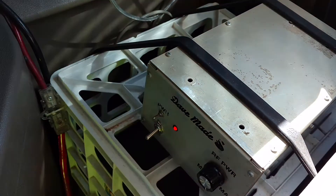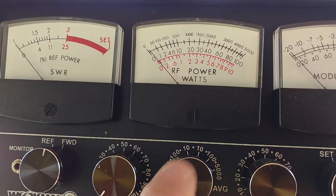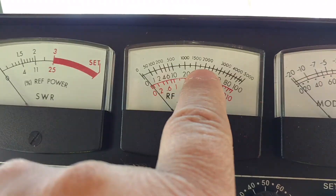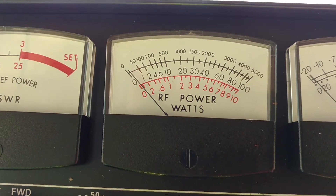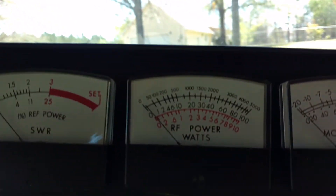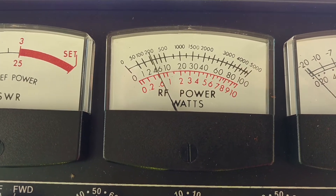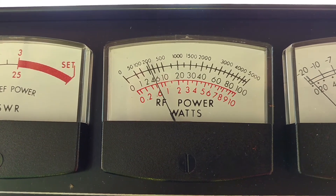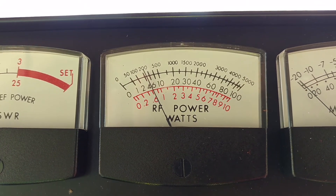Power wide open. Now we're on the 5000 scale right here, on the top line up here. Turn my mic gain up — it's already up. We're on the top scale. Dead keying in about 250 into the box — about a 250 watt carrier.